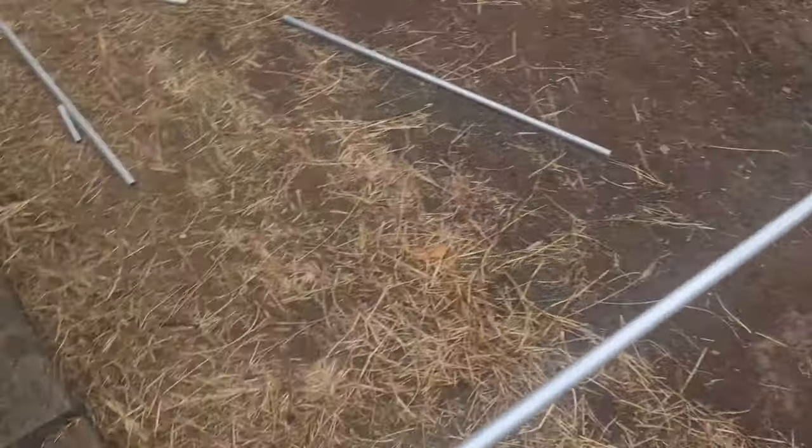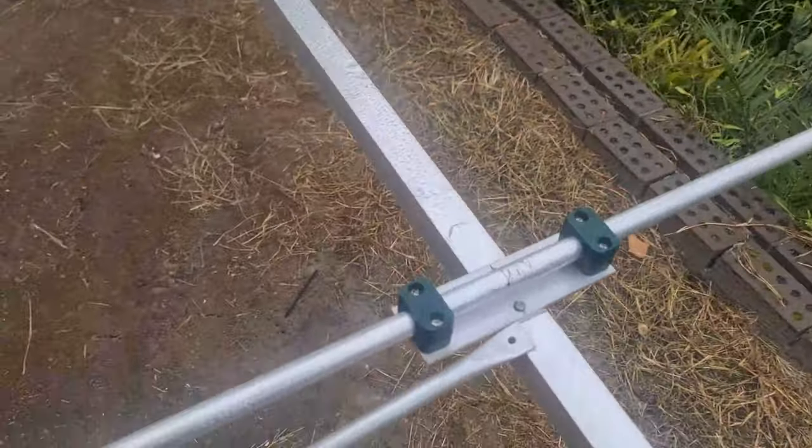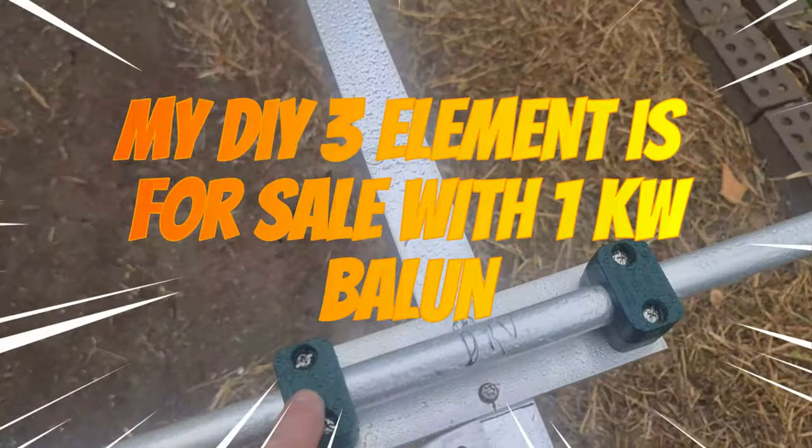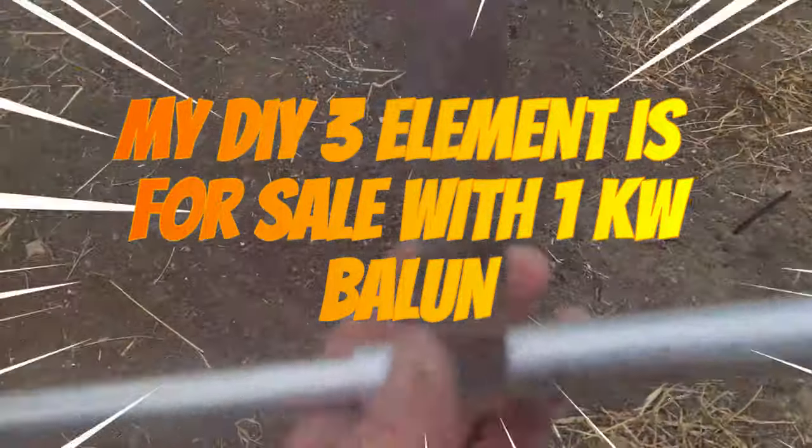This is the driven element here — it's roughly its size. It's an insulated beam, so all the radials are insulated off the beam. I'm having a go at doing a gamma match, so I've just bent up the arm here. What I've done is used some 19mm tube with some 12mm inner tube, and I've just used some heat shrink on the inner tube.